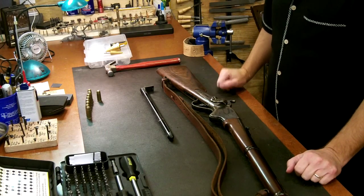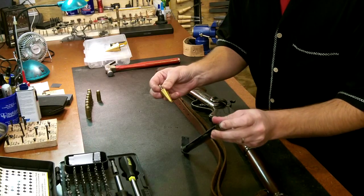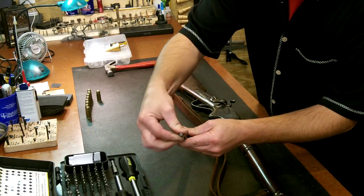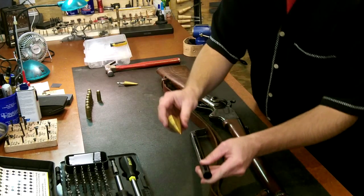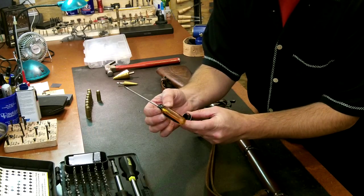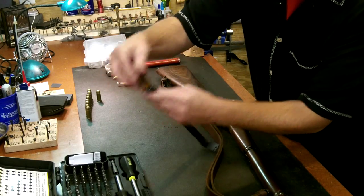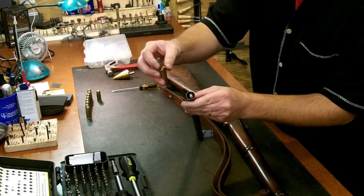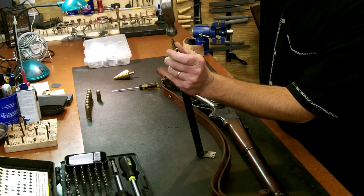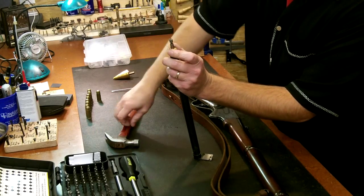To flare the magazine tube, you only need a couple of items. You need the tube and something to flare it with. I like to use a taper drill bit — it's tapered out enough that when you insert it, it's just larger than the opening at the end of the magazine tube. You can also use a step drill bit, or at a pinch, the back end of a screwdriver with a small handle, or a dowel that's been tapered down on the end. All you want to do is insert that tapered object and give it a little tap. I've already done mine — it doesn't take much, just a little tap.